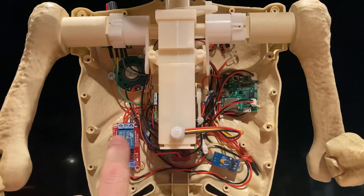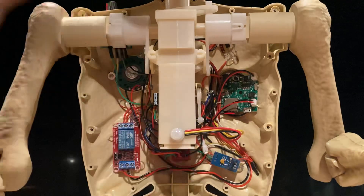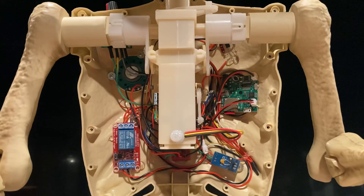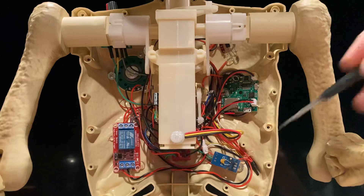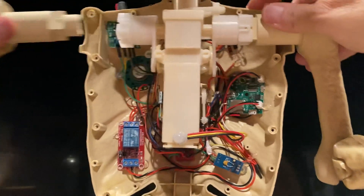When the audio board turns on, then the relay closes and the whole sequence starts. When the sequence is done, the relay de-energizes, shuts the motor off, shuts the eyeballs off — unless I have it overridden with the switch. So it's kind of like what I did with Zoltar; the method and theory is all there. I wanted the eyes to flash, so I bought some of these pulse generators from Amazon and utilized that.